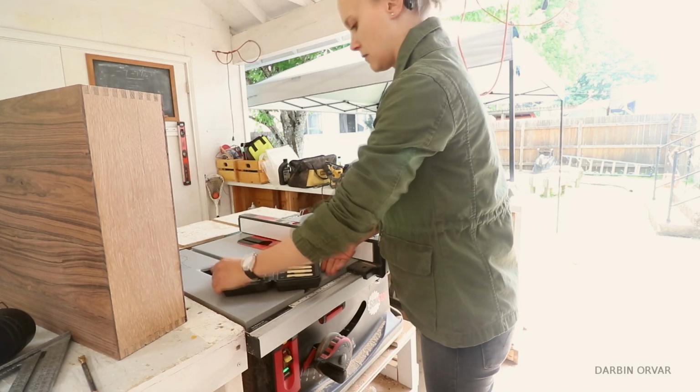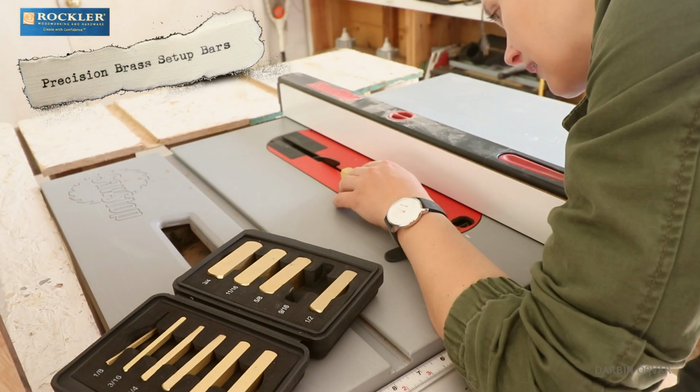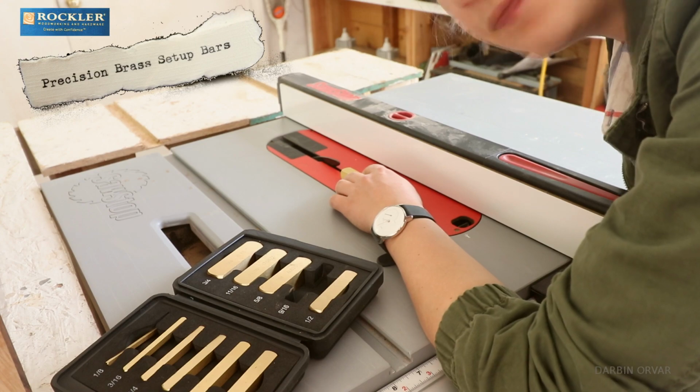So last night Matt came out here and did some sanding and some planing on the corners. So now it's time to cut the box open on the table saw. Okay, cool. So that is just over half inch. Yeah, so it'll cut through the box and nothing more. Mm-hmm. It's as low as it can be.